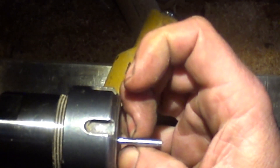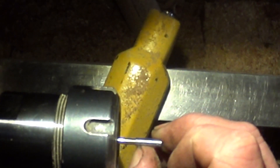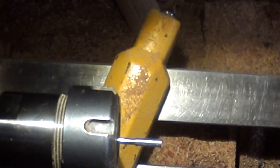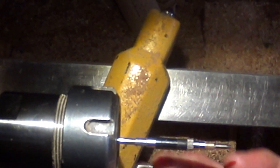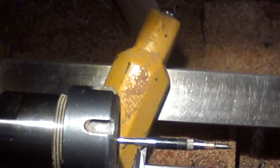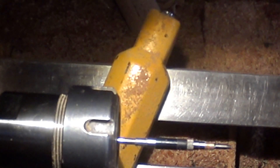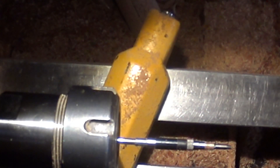It's coming in at 3.2 — standard Dremel shank — then going out to 4mm. I've left the first millimetre at 4 because I want a hard shoulder for this to butt up against, and the rest is now reduced down so it just slips inside there. I've got to take off four and a half millimetres so it goes all the way up to that shoulder I left back here. I'm going to use the Dremel cutoff again to cut off that four and a half millimetres.